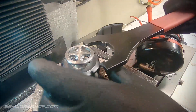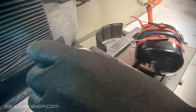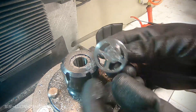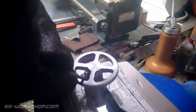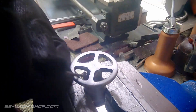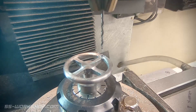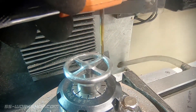With the openings cut in the hand wheel, the next step is to take it back to the bench. There I'll file the inside curves of the hand wheel using a small needle file. While I was doing the filing, I realised I need to make a relief in the face, so I popped it back in the lathe and sorted that out. The next step is a threaded hole for the handle, so I drill a tap sized hole and then tap the hole, using a spring tapping guide to keep it centred.